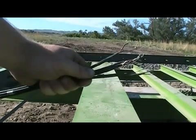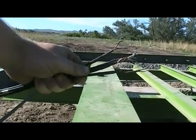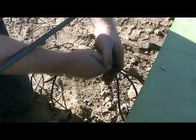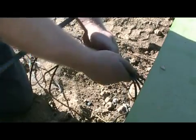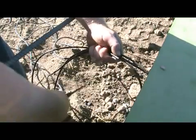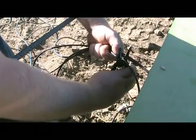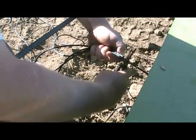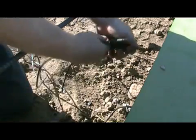Once you have run all the load cell wires through, take the ends of the wires and hold them together. Then run it through your hands, making sure none of the wires move independent of each other, all the way up to the junction box. This eliminates the excess wire while leaving the length of the wires the same as to not affect the calibration.